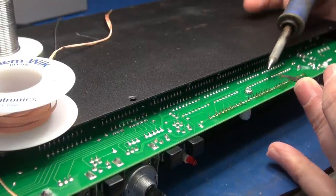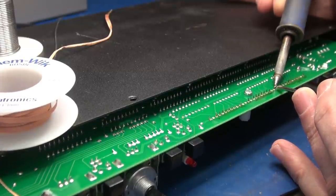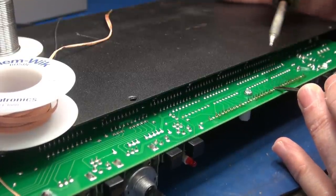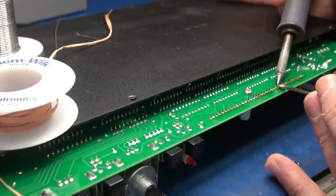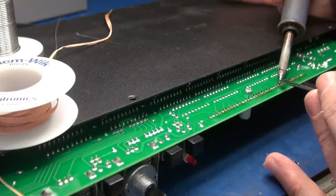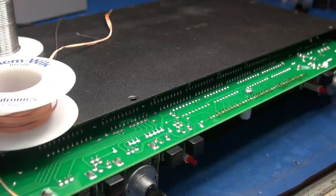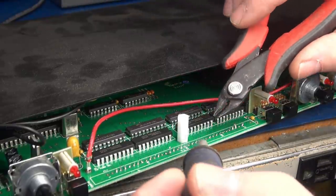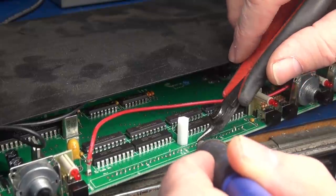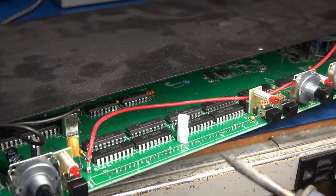Here's a little tech tip: you can take a flat blade screwdriver, heat the pin up, and push it down with the screwdriver, and you'll be able to get around the top and finish the operation. This is the most tedious part, but your efforts will be rewarded with a working display. You can see the pins poking up — grab a pair of wire cutters since they're so fine and pop them right out. Go through and remove them, clear the holes with some more solder wick, and then we're ready to put the display on.